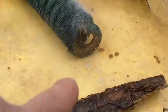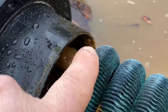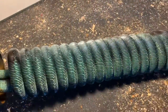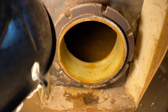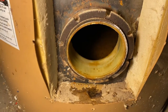I'm going to get all that rinsed off — see the chunks coming out? It should make a big difference. If you look down in there, you can see all the chunks. So hopefully once we get this thing all rinsed off the heat will transfer through this coil a lot better. We've got the coil pretty well rinsed out, as good as we're going to get it. All the heavy sludge is definitely off of it — it looks a lot better now. There is some sediment in the bottom, but we're not going to mess with that. We just want to see if we can get this back together and get the heat to transfer through to the water heater so we can heat up the domestic hot water.